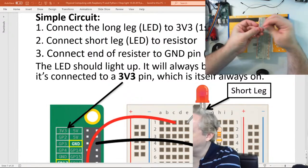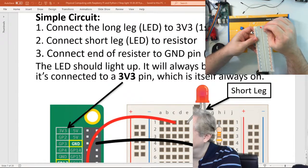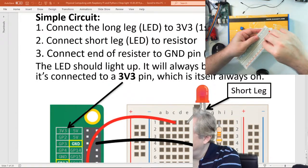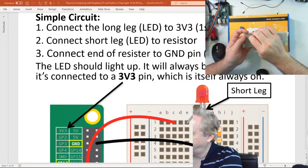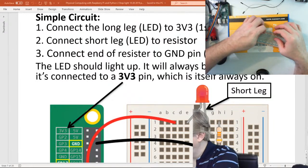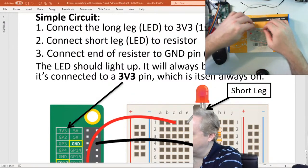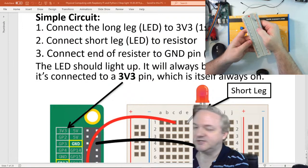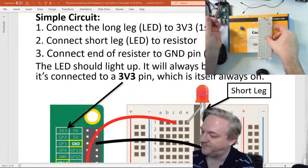And we're actually going to get our resistor. We're going to make sure our resistor is on the same row. Okay. And we're going to bend our resistor maybe down here to see where I can go. It's to 19, it's not stretching fully to 20, okay? The big thing is I don't have to jam it all the way in. I've had students that take their finger and really start to cram it down there. You really don't have to, it just kind of has to touch the bottom, okay?